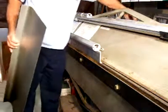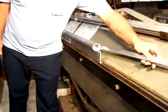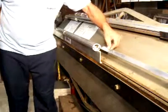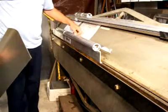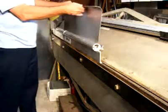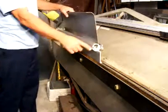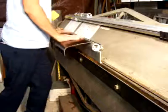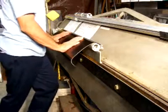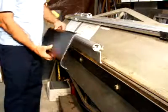We could do this same bend as well, a 1/2 inch shorter, by taking the L shim that we used in the T slot earlier and sliding it in the loop of the J die. This 1/8 of an inch shim creates just a tighter space for the material to sit in when you're forming it over the die, and just that 1/8 inch movement of placement of the material creates a flange that's about a 1/2 inch shorter than the first one we did. So you have these 2 adjustments here depending on what kind of part you're going to make.